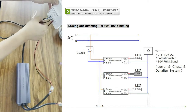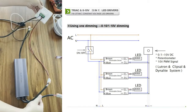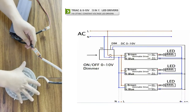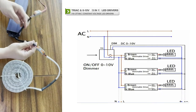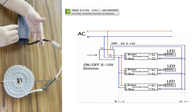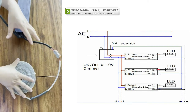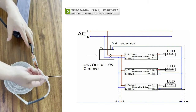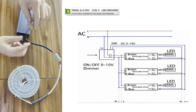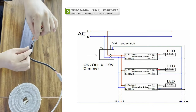The positive and negative output connects to the dimming signal wire on the upper side. These three groups — well, the output doesn't need any dimming controller. Just connect the LED driver output wire to the LED strip or LED light directly. No dimming controller needed. And this one is the 0-to-10 signal wire.